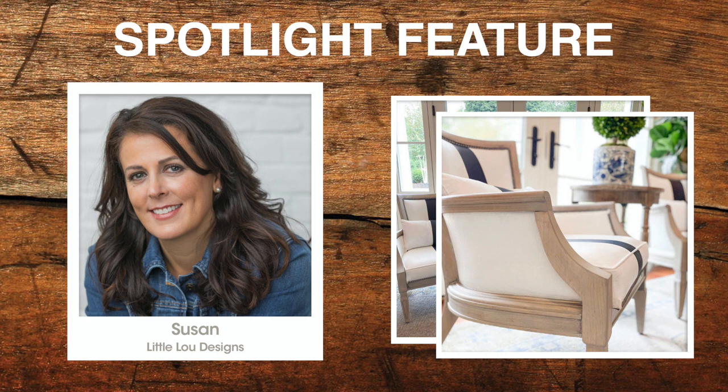The last coat I waxed over it. I used Annie Sloan white wax for the wood and the white paint, and a clear wax for the blue so I didn't want to dull it down at all. It was a long process, but I was happy with the end result. I did not remove the nail heads that lined the chair because I'm still far from perfecting the application of nail heads in a straight line. So I just kept them, sanded them, and painted them silver so they'd go better with the color scheme. They were a brownie, yellowy brass color to begin with.